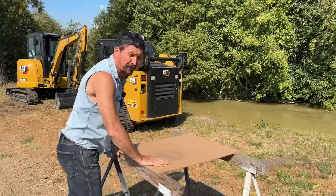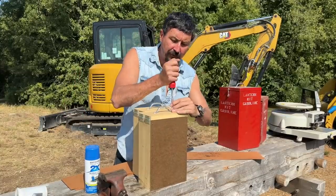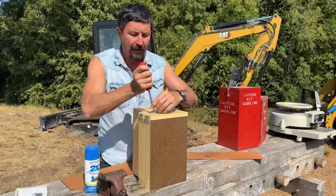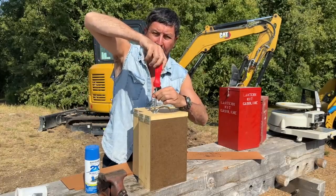I've got some old hardboard here that I just use for spraying — it's nice to keep this around the shop. Gentlemen, I don't care what your best friend tells you — you cannot get a proper paint job without removing hardware. Don't mask it off; just take a moment and get it off. There's nothing like mounting clean, crisp hardware on a fresh painted surface.